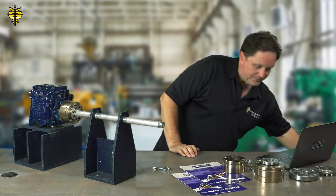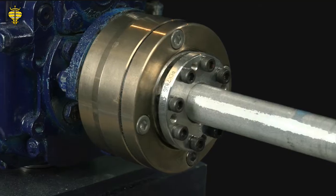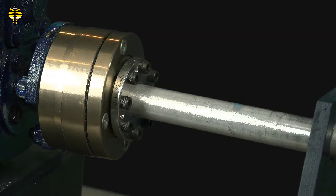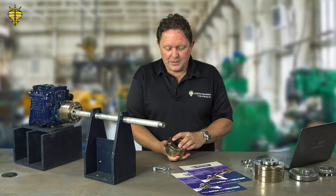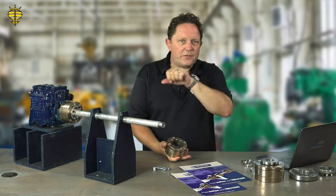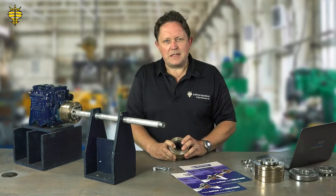So, Sigma Drive. I like to think of Sigma Drive as a spherical thrust coupler. Most of the other coupling systems — pretty much all of them on the market — that have some movement system in them are constant velocity type couplers. They're the joints that you'd see under trucks where the drive shaft comes down and bends, adding some motion into the drive system to add some flexibility.